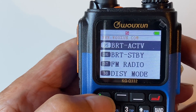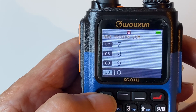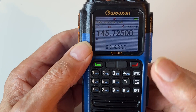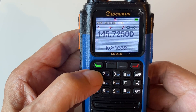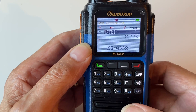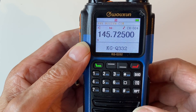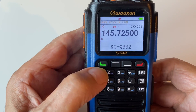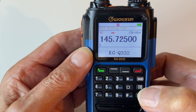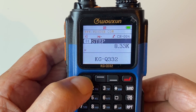We can adjust the brightness of the screen both when it's active and when it's on standby. In the appropriate menu you've got BRT active and standby. Press that button and you can set the screen levels — 10 is the brightest and one is the lowest. On this radio there are two menu systems: the primary menu relates to items you'd want to change per channel or per frequency, accessed by a quick press on the menu button. The secondary menu relates to general items like screen brightness, accessed by holding the button for about two seconds.